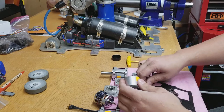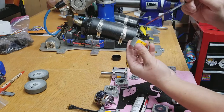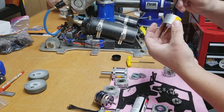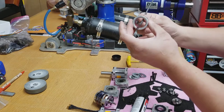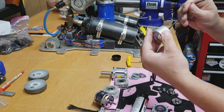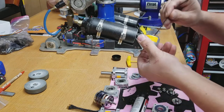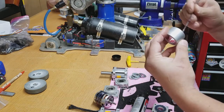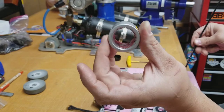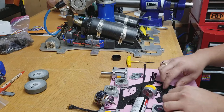So what I like to do is I use a zip tie and then just apply a couple of swabs, zip tie worth onto that ring gear. Don't go crazy with it — you can use too much. Just a couple of swabs, go in for another swab, kind of make sure it looks sort of even. I think you can see that that's good enough. Don't go crazy. So the ring gear is good.